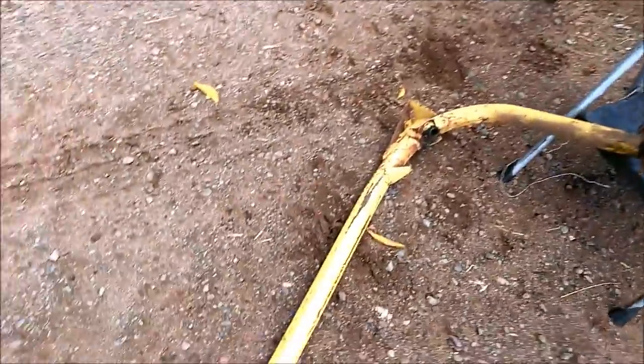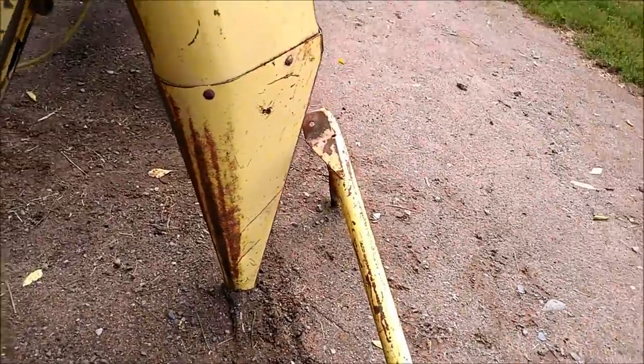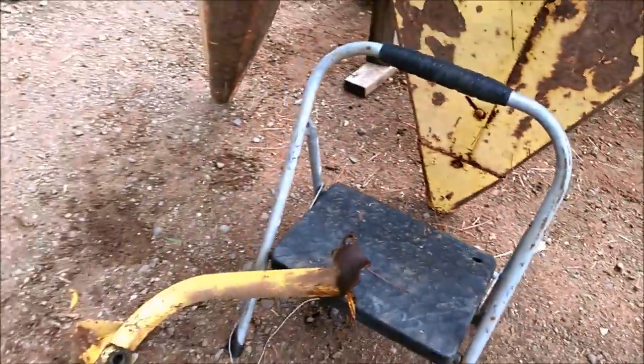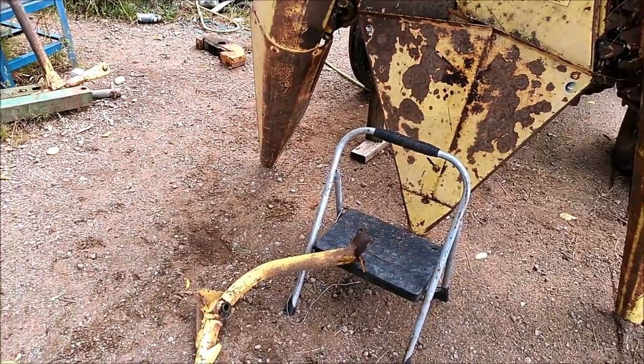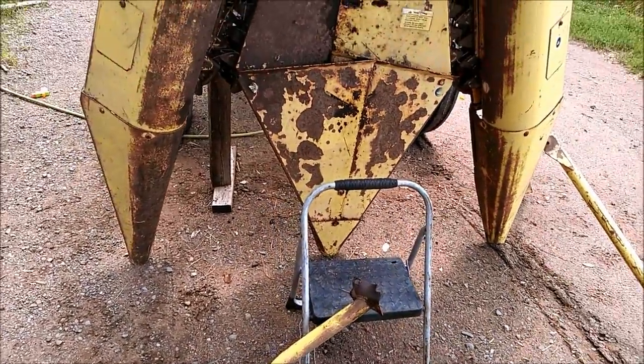Monday August 31st, beautiful morning. Got a nice rain this morning, just under an inch, supposed to be nice all week. Probably start cutting some more hay tomorrow. Right now I'm working on this corn head for the New Holland — that 790 chopper we bought, this 822 New Holland. I pulled off these bars that guide the corn in — they go up over the top. They were loose, and this bracket has been broke and the other one is starting to crack. I'm gonna take them in to the welding shop and get new ends put on them to strengthen that up.